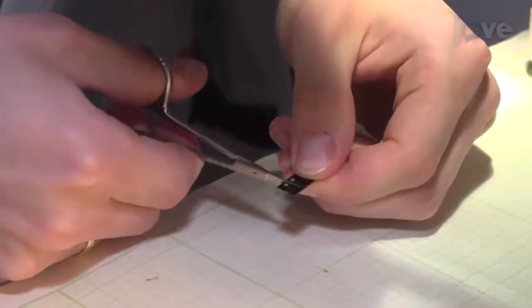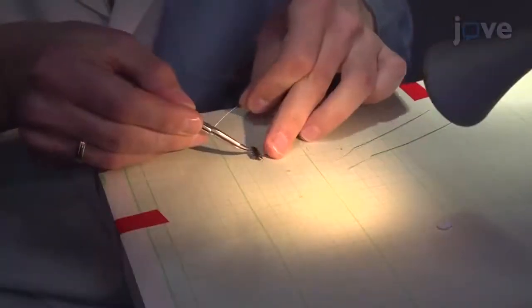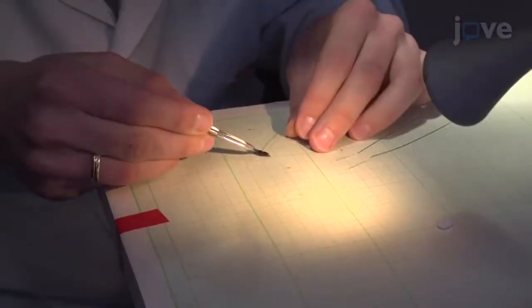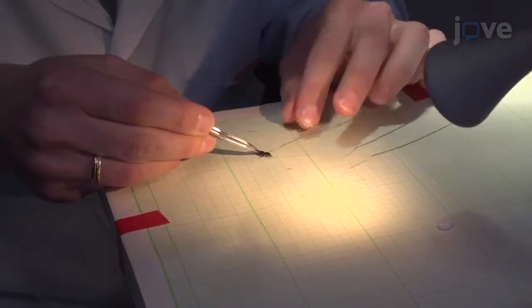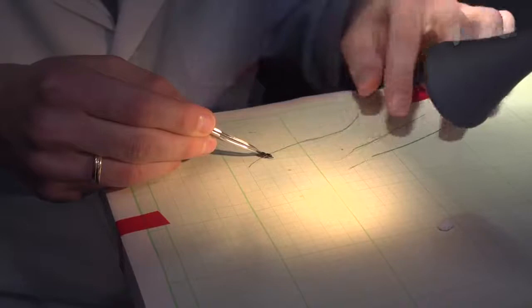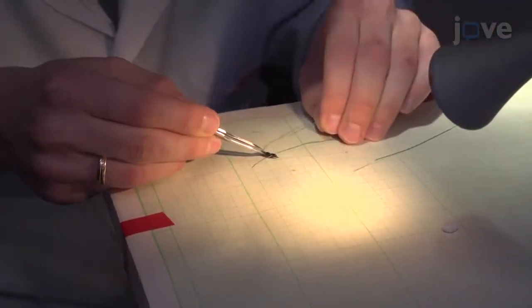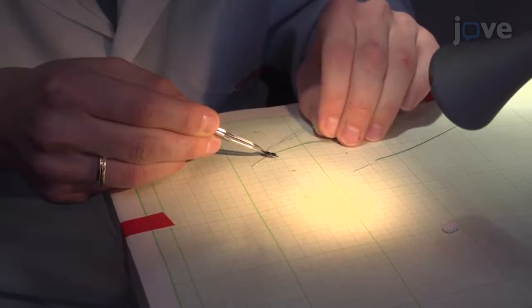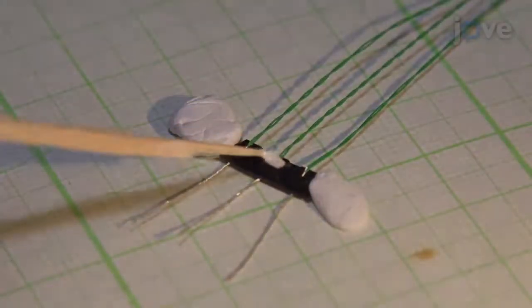Afterward, acquire a strip of three-tape packaging of any integrated circuit with SOT353 case. Stitch the twisted wires through the three holes of the package. The longer peeled segment of the wires should be in the cavities of the package. Position the cables so that the end of the insulation is in line with the edge of the holes. Then apply dental cement on the holes to fix the wires.